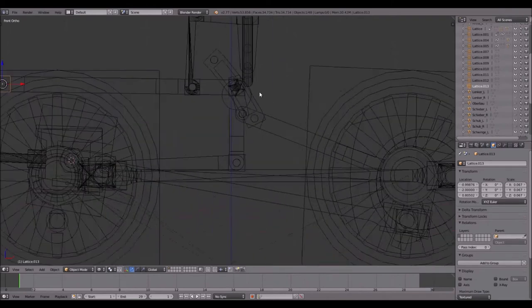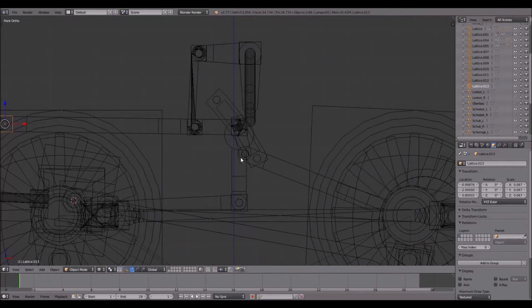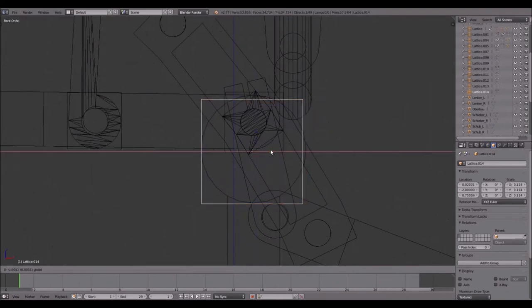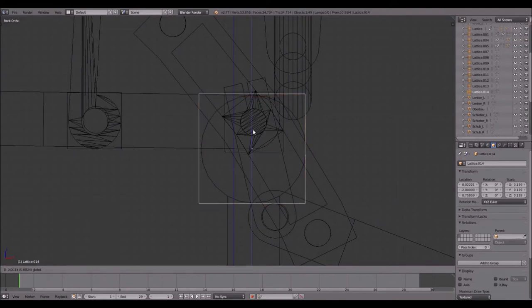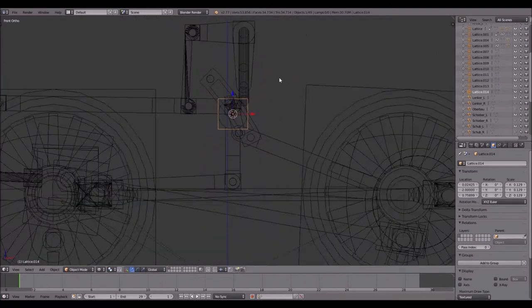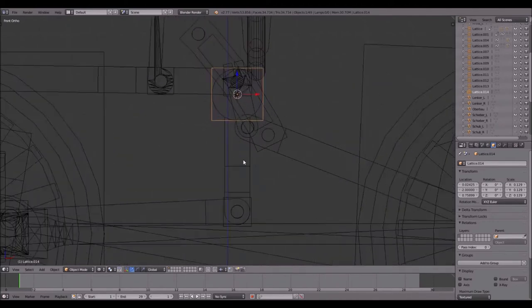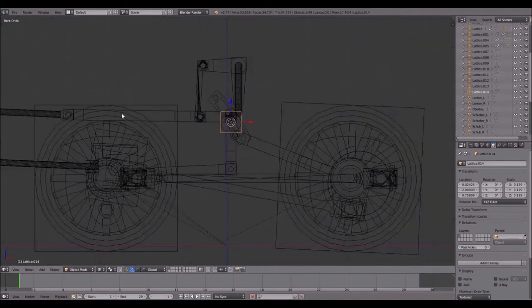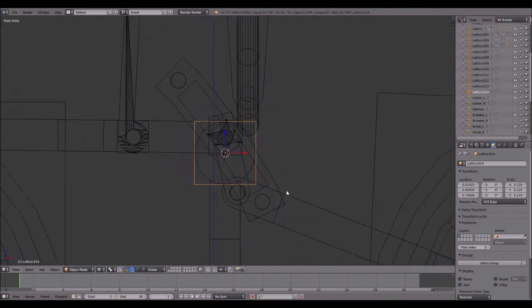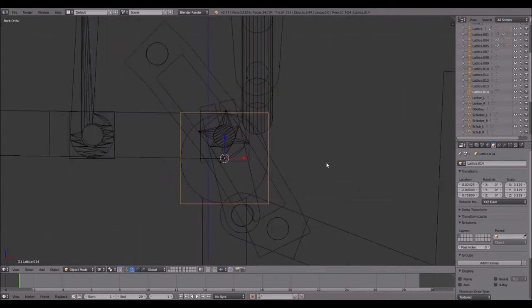The next step would be to animate the combination lever. The Bagnall valve gear is by basic principle very similar to the Walschaerts valve gear because it combines two motions to move the valve. It's basically the Walschaerts valve gear: you have the combination lever driven from the crosshead which moves the valve by the lap and lead, and then the eccentrics — usually a return crank in Walschaerts — which moves the link responsible for forward and backward of the locomotive.